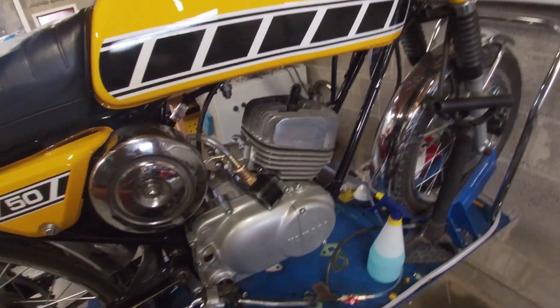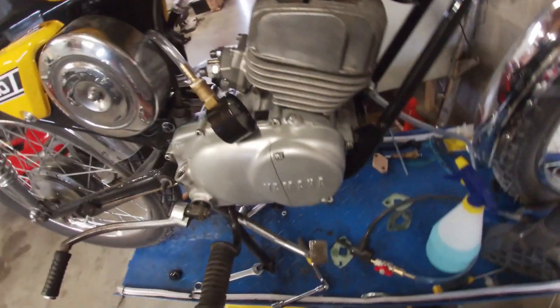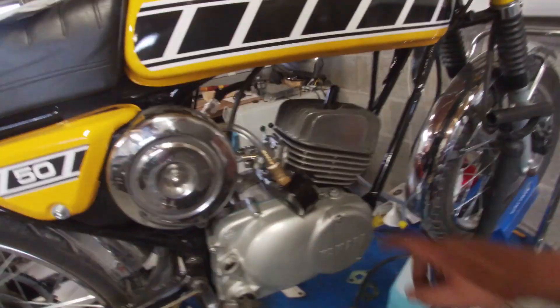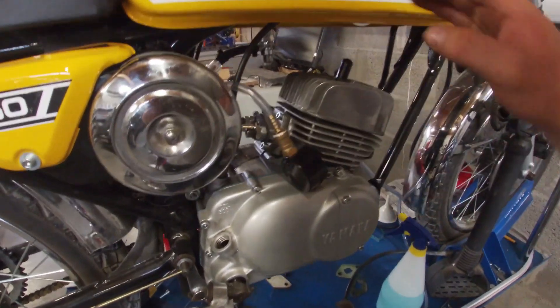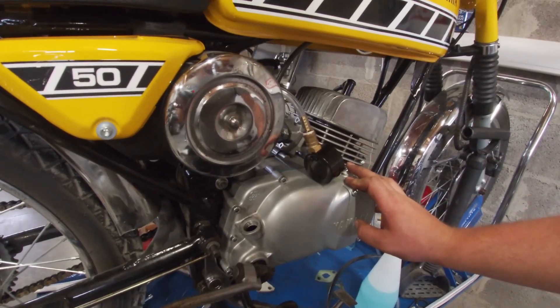So that's how you perform a leak down test on a two-stroke engine: just block off the intake, block off the exhaust, make sure the spark plug is in, and then give it some pressure. If it's an outside leak you can find it with soapy water — bubbles should start coming out. On the exhaust port I can't really seal it 100%, so you can see it starts to bubble a bit. I've also found the issue inside the transmission — that's probably also why this engine smokes a lot lately, because it's probably sucking in transmission oil and burning that up. If you liked this video and thought this was helpful, consider liking and subscribing for more, and I will see you guys in the next one — ciao!